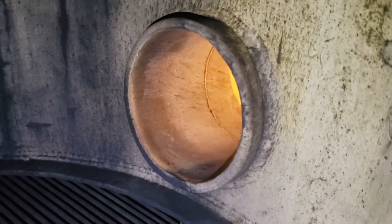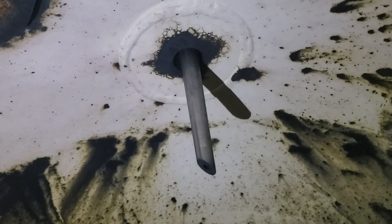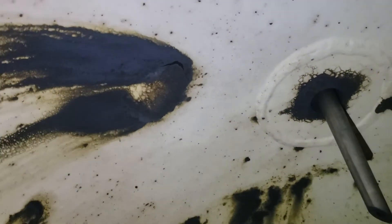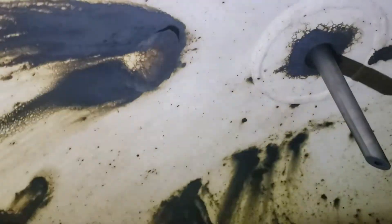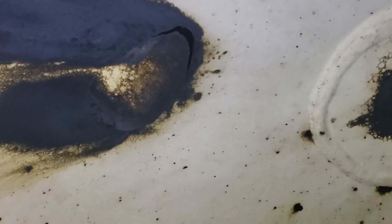I thought I'd bring you along and show you the inside of this — it's not very often you guys get to see these. Let's look up here at the top head. Got a probe — nothing crazy about that. Notice the coating. Here's what I want to show you guys: it's a coating failure or coating holiday. It's peeling up, kind of like a potato chip, but the coating did not bond to the shell at this location and over time it's peeling away from the head.